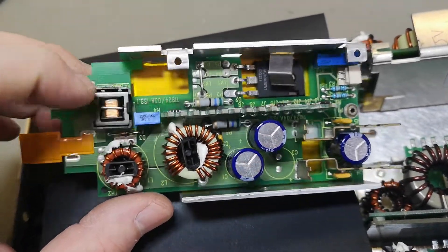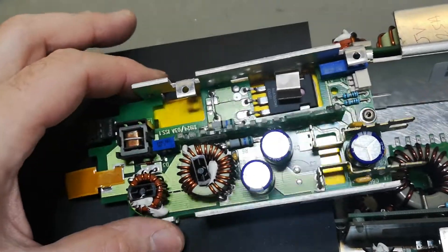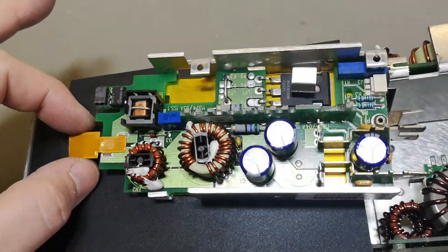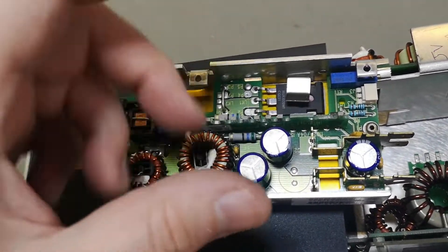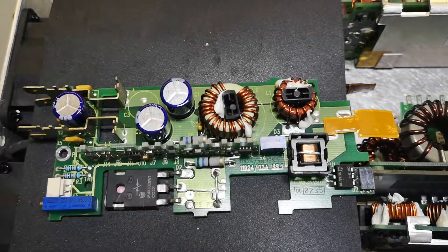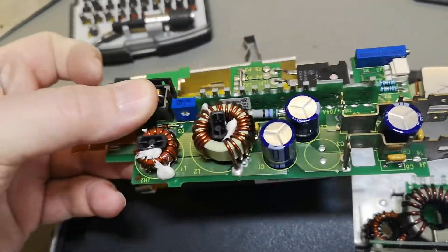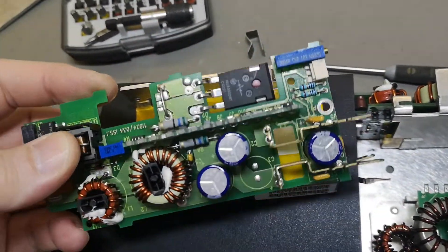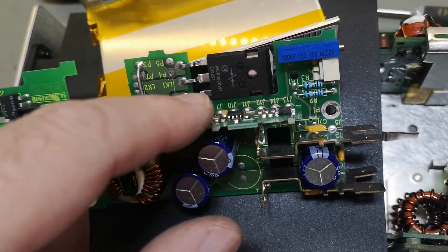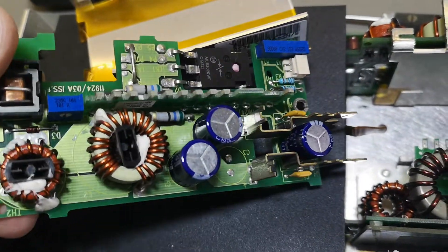This dead module was supposed to be a 12 volt, 16 amp module. There's an input current sense, a little switcher transistor, and then a diode — and you're done. So this is like a simple buck regulator for the output, living off the AC input, ready to chop it into regulated bits. Looking at the bottom side, it's a really good example of how to manufacture stuff cheaply and easily — just click it in and flip it onto the diode and you're done. It's a double diode but one of them is broken, which is why you only have half the voltage.